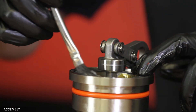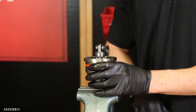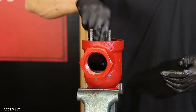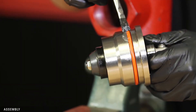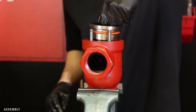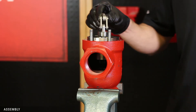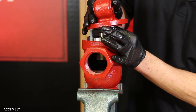Grease the top of the cylinder and place the gasket on top, then apply more grease on top of the gasket. Remove the piston assembly and mount the valve body onto the vise. Carefully attach the gasket to the removable seat, thread the seat into the body by hand, and tighten with the Kimray removable seat tool. Grease the O-ring on the piston assembly and push it down into the valve body — if it doesn't slide in easily, it may be crooked. Place the bonnet on top of the body, verifying that the trunnion hub is in the correct position.